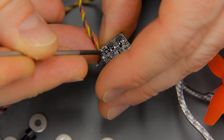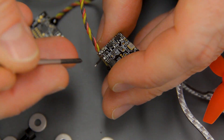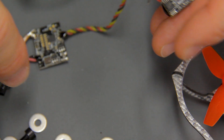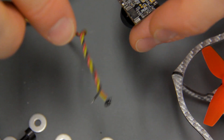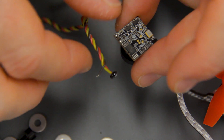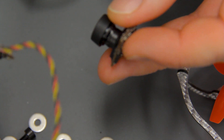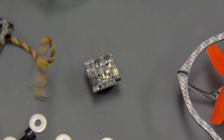I tried with a hobby knife and different tools to get access to some traces I could solder to, but I couldn't do anything about it — it was really sad. I tried again with another one of these and it did the exact same thing: came off the positive and negative, but ripped the soldering pad off the signal wire. These sat around for months, maybe even a year, before I decided I wanted to try and figure out how to make them work again.